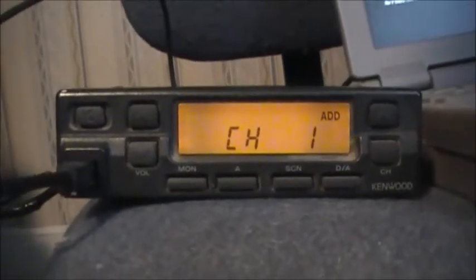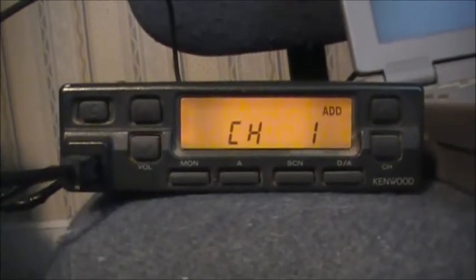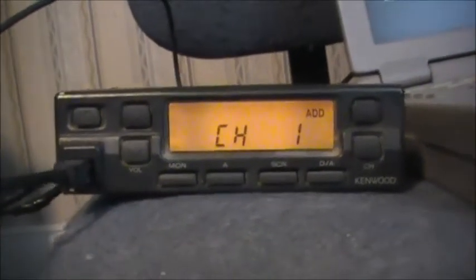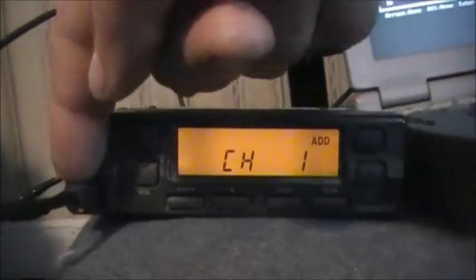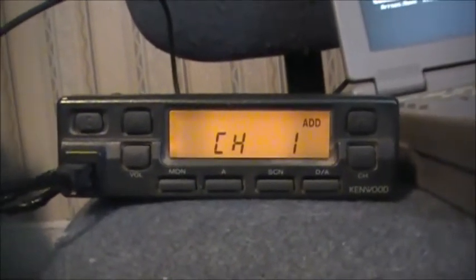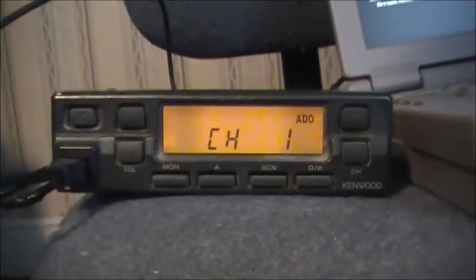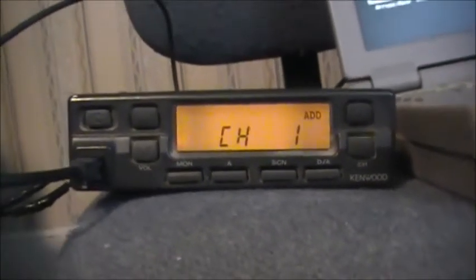Originally, I bought the cable off eBay. It's just a DB9 to RJ45, well, I know it's not really RJ45. It's a 6-pin network plug. The RJ45 has 8 pins, obviously, but this one only has 6. And the actual interface board is on the COM port, on that part of it. So I'll show you some mods that had to be done to make that board work.